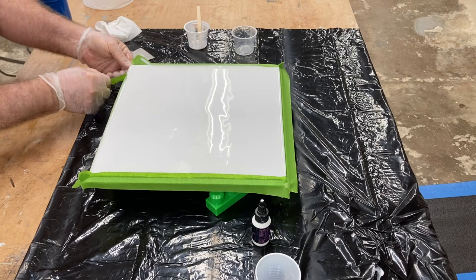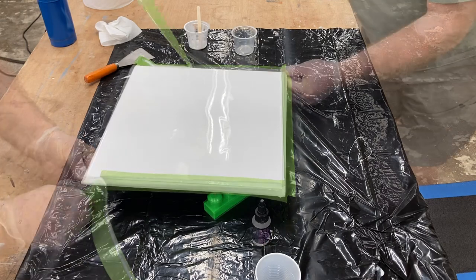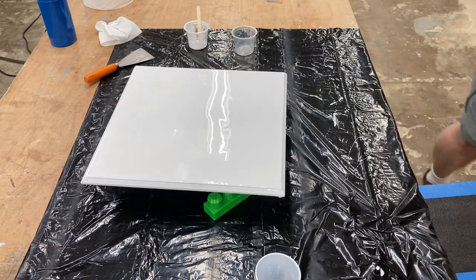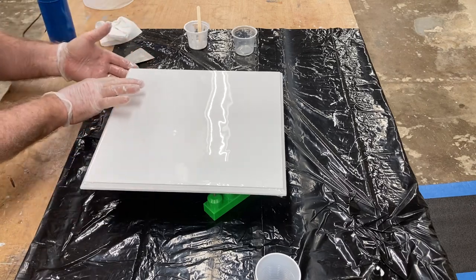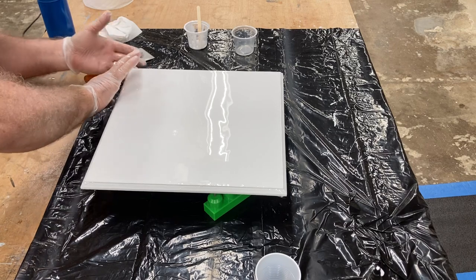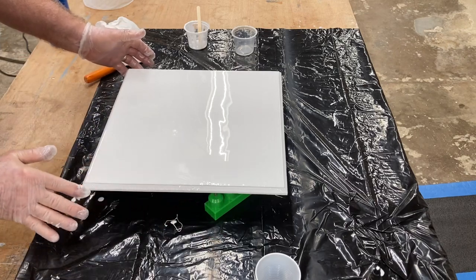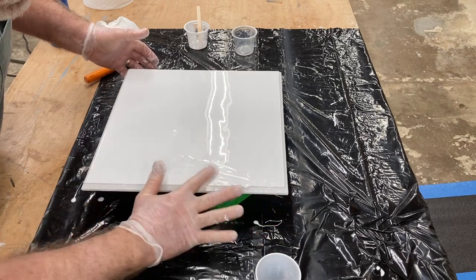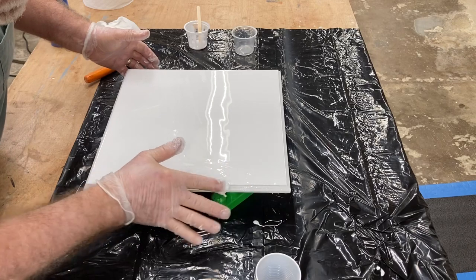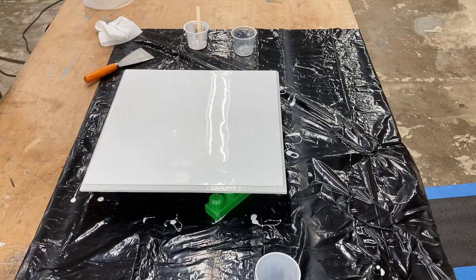It's time to remove the tape. I want this epoxy to flow over the edge and completely coat the edge of this profile. Remember, this is not a typical roundover, so it's going to need a little help to get the epoxy to flow. The surface tension is rather significant and it does not want to flow over the edge on its own. So this is where you get your hands involved to help cover the edge of this profile. I have plenty of epoxy on the surface, so it's no problem dragging it over the edge to completely coat it. Don't worry about damaging it - this is self-leveling and we'll have a perfectly smooth glass-like finish in the end.